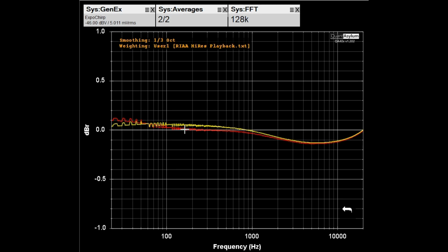We got a little bit of weird stuff going on there, but it's not really that big of a deal. That's what, 0.05 dB maybe. It's just not anything that's substantial, and the channels are very well balanced, and we are at worst case maybe, we'll just say 0.2 dB. So it is meeting the Phono specification for a moving magnet cartridge.